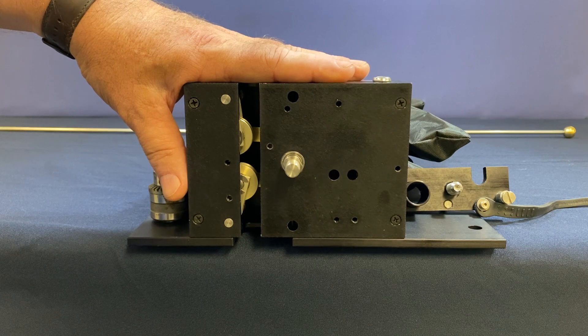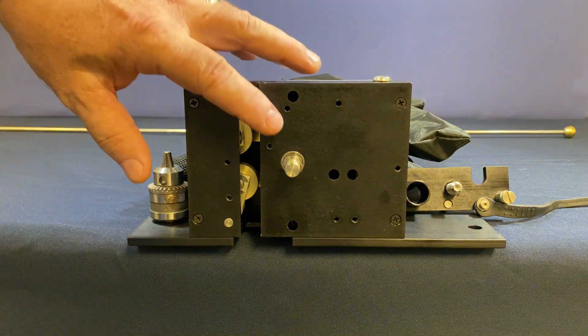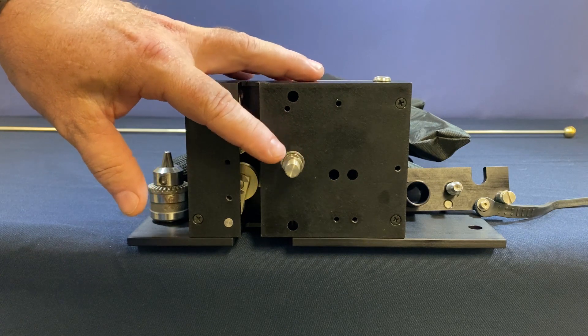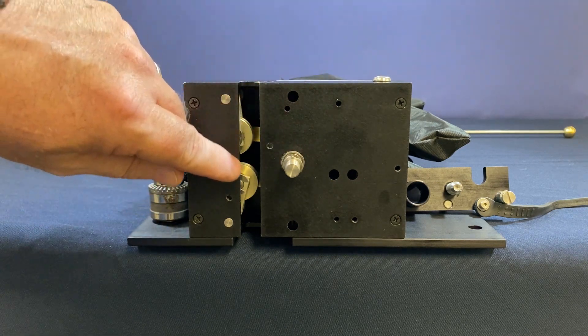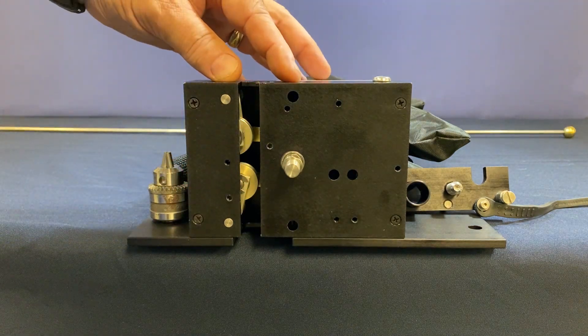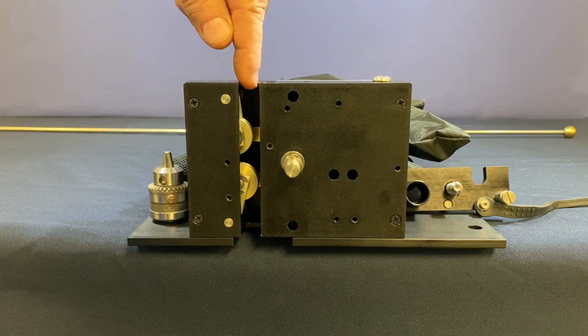What's unique about the TR-3190 is that it can be used either as a linear transducer or a rotary transducer. There are a few things we need to know about the configuration of it. I want to point out the rotary mechanism on the front of the transducer, as well as these wheels here, which can be used when we convert this into a linear transducer by putting a rod down through them. We'll show you that in a moment.